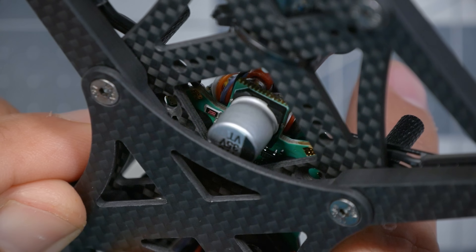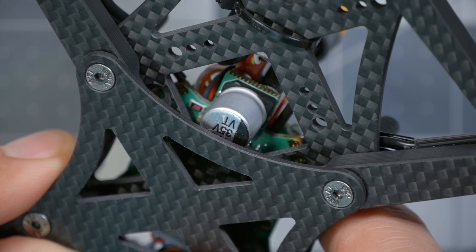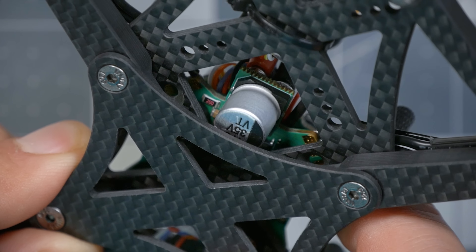There's another weird thing about this Blitz ESC: they install a capacitor — ESCs should have capacitors — but it's a surface-mount capacitor mounted going down off the bottom of the ESC, so it kind of hangs out below the bottom of the quad. This is weird because it makes the ESC hard to fit into some frames, and the other problem is that it just breaks off in an impact sometimes. Then you're going to have to solder a new one on, since you probably can't do surface-mount soldering yourself. On a long enough timeline, you'll probably need to solder a new capacitor on. Whereas if they had used wires, that wouldn't be the case.